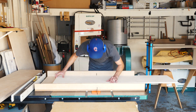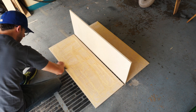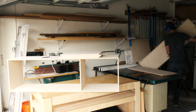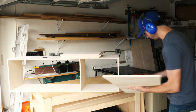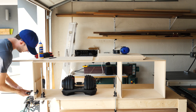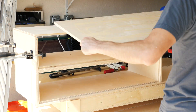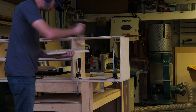After I finished cutting the rest of my pieces to width and length, I made this sort of sandwiched shelf piece that uses one of the wider pieces and two of the narrower pieces, and then left that to glue up. Then I started assembling all the interior pieces. I found that the easiest way to do this was to cut them to final length by referencing the interior of the cabinet. Sometimes I'd nail it on the first shot, and sometimes I'd have to walk back and forth making cuts and trying to fit the piece five times or so. Basically, you just want to keep nibbling away at the piece until it fits. Remember, you can always keep removing material, but it's a lot more difficult to add it back on.